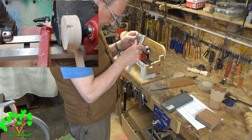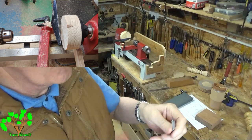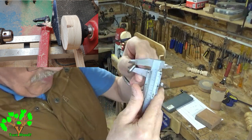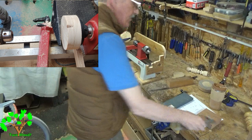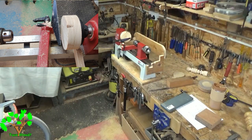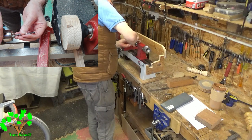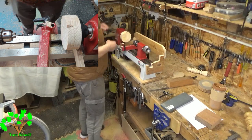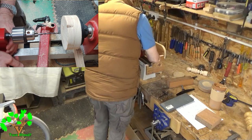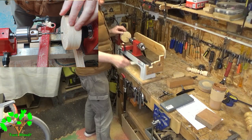Well, actually, because of the type of screw it is, we've got a plain portion there, so it won't screw in properly. So we'll make it slightly smaller than that. We'll measure the actual plain part, which is 5mm. So we get a 5mm drill. Lock that in place. Take our tool post out. Then we'll drill a hole 35mm right through.